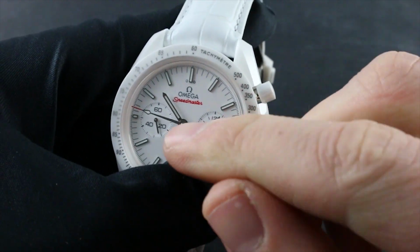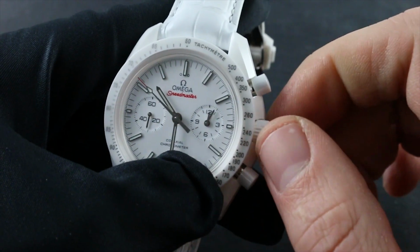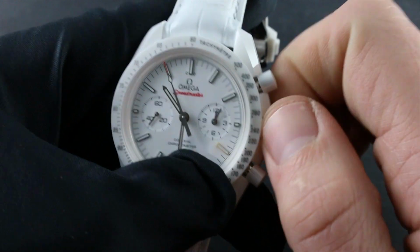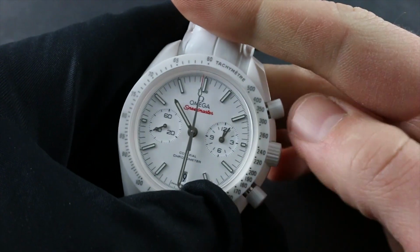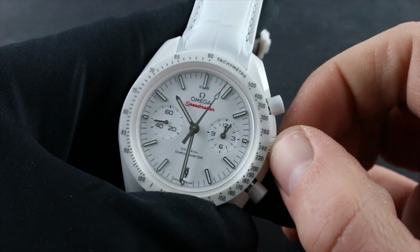You'll see at a minimum whether the chronograph is running or not. Constant seconds at 9 o'clock start to advance. By turning 30 to 40 times, you give the movement a buffer power reserve from which it can then start to wind itself. Now, once you have wound the watch and it's running, you can set the date, you can set the time, you can put it on the wrist, it will continue to wind itself.